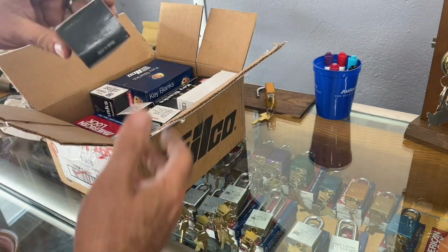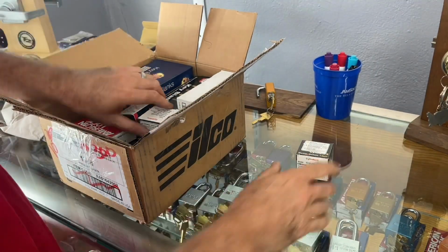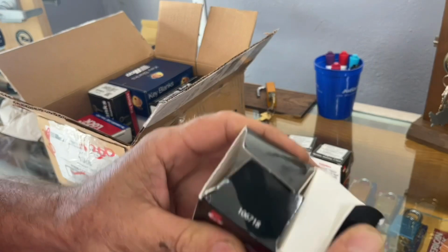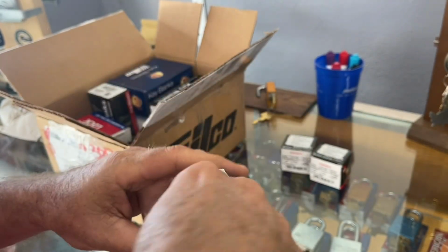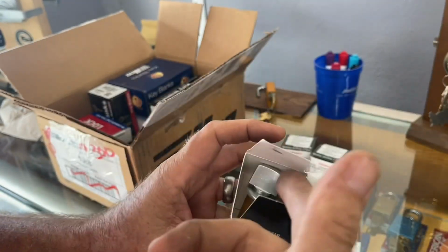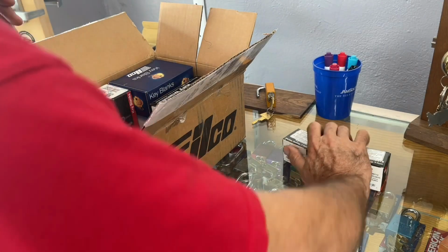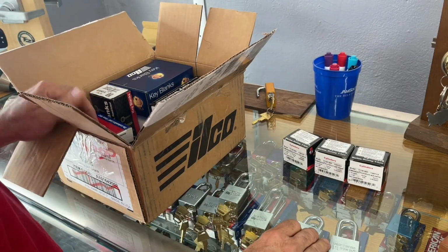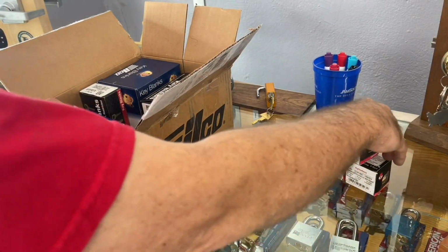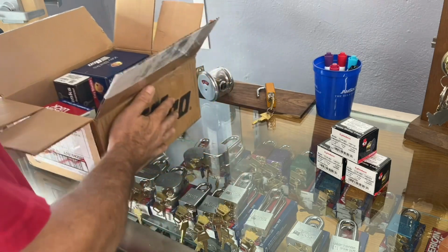1-inch thumb turns. For some reason, Acme cannot get one of the most popular things in the world, a thumb turn. So I had to order 1 1/8 just so I would have them. One bad thing about having 1 1/8 over 1 inch is I have to switch the cam. It comes with both, but the 1-inch comes with the Adams Rite cam. The 1 1/8 and 1 1/4 always come with the Yale cam, so I can't just slap it on the door. So I got 3 of those just to hold me over until I order from somewhere else who actually has stock, or I am able to wait long enough to get those.